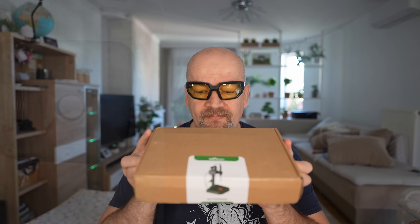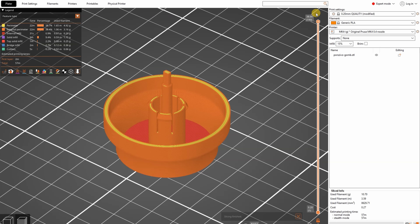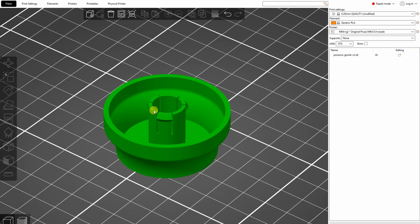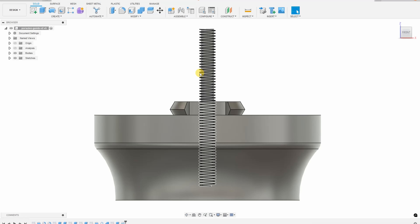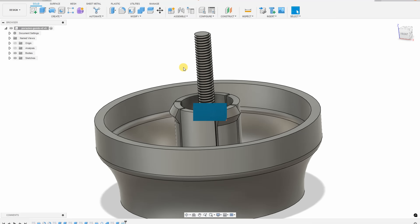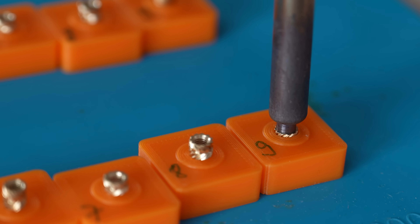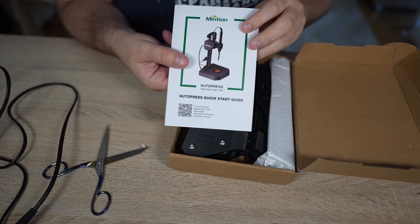In most cases I could solve everything with the cheap tool, but even being quite experienced, in my last project I could have used something like this. A student asked me if we could repair a broken push button. In our first design, the middle part was quite weak because of weaker layer adhesion. In the second version, we decided to use a threaded insert and a metallic bolt inside — it will be much stronger. But here it was very important that the metallic bolt be at a 90-degree angle with the flat surface, so we had to insert the threaded inserts quite accurately. Usually I solve this by inserting almost completely and then pressing on a flat surface, but in this case I don't have enough space because the threaded insert is inside the hole.